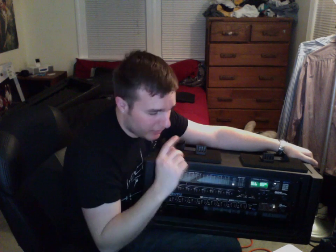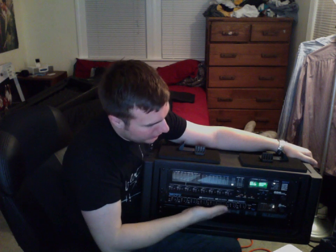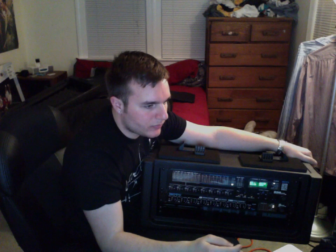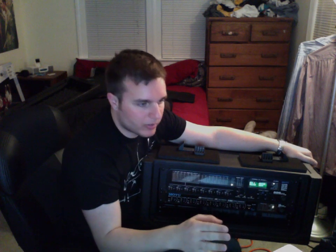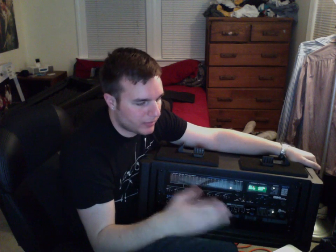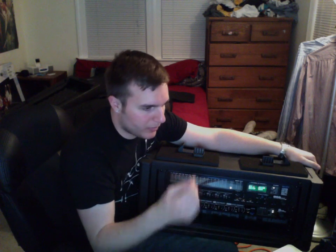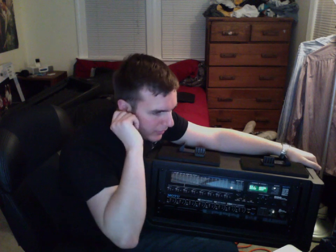So you want to set your clock source to ADAT optical A, because, again, that's syncing it to the 8 pre. You want to make sure all the optical input banks are just set to ADAT optical. So for input bank A, output bank A, input bank B, output bank B, just make sure all those are set to optical. You're not using bank B, but just whatever, do that anyway.